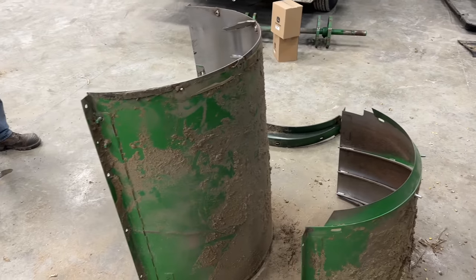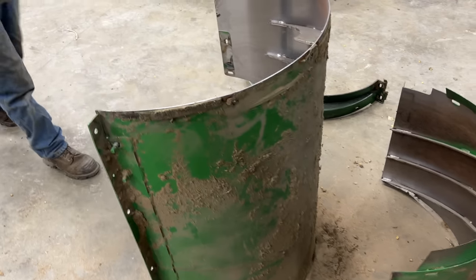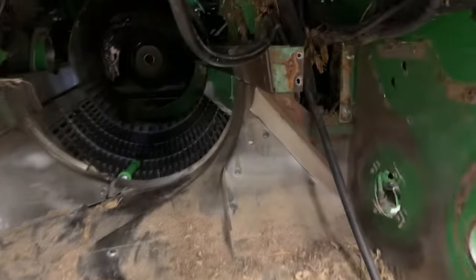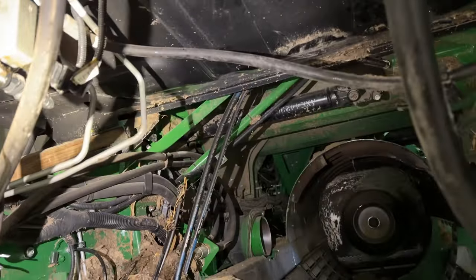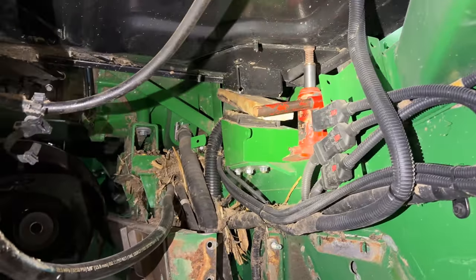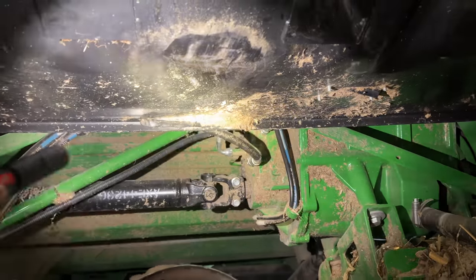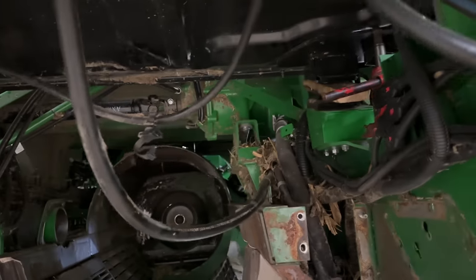So 3 years later, no, I'm just kidding. It wasn't too bad. We got the middle shroud, or the cover, I should say, out. And what we did in this particular situation is we jacked up the cab, took the rear cab bolts out and loosened the front. Then I jacked the cab up about 3 inches or so, and then it'll clear because the rotor covers hit right in here. So if you just jack the cab up a few inches, tilt it forward, they will come out.